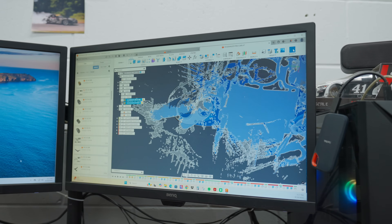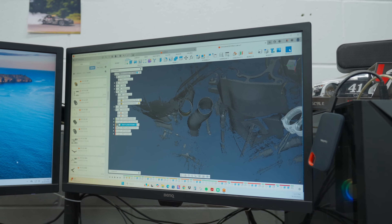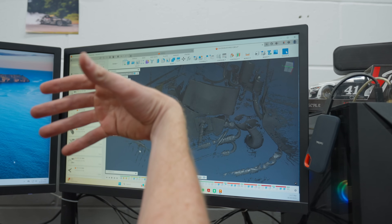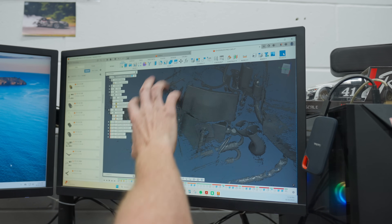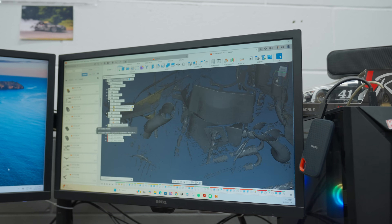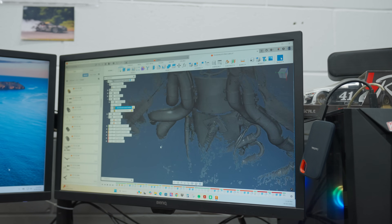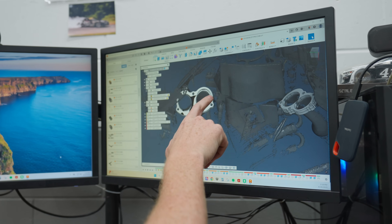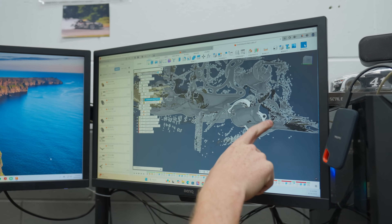That plane is what I was then able to draw flanges on and eventually make a mating flange. On this side, same thing. What was cooler was after I did this first scan, I then did a second scan — you can see how that looks, so I'm able to see the fully cut tube as well. The original scan was to get the entire shape of the exhaust while it was still in its original position — a snapshot of where it needs to be — so when I make all these flanges, they're able to clear the bends of the tubing and the chassis, and we're able to get a socket in there.